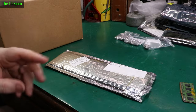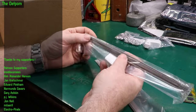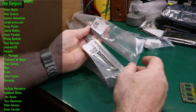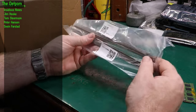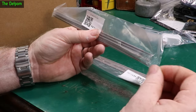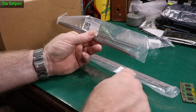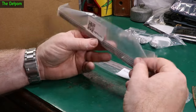Now the next item — I've already opened this up because I needed to use what's in it. These are some 1mm welding rods, mild steel, 6013. I bought 50 of them and I've already used 30. These really thin ones are arc welding — stick welding. They're really good for rebuilding really thin sheet steel, like little brackets or thin sheet metal, because you can use much lower current to melt the electrode and weld much thinner steel without burning holes through it. This just makes it a lot easier.